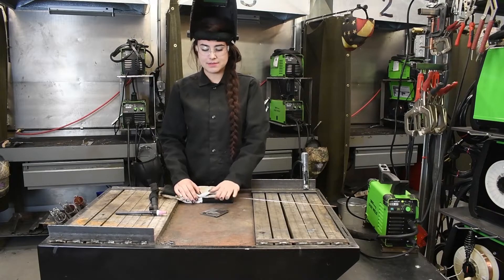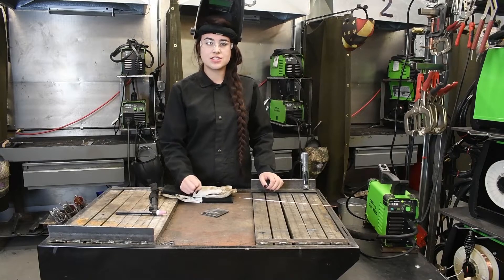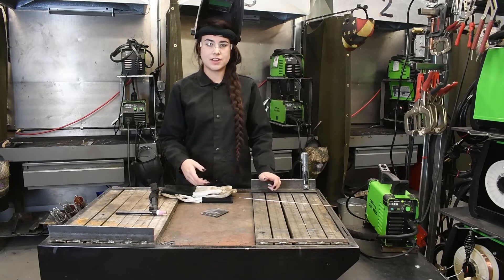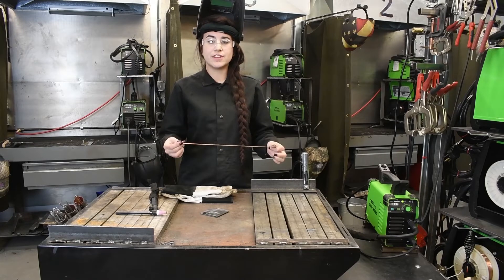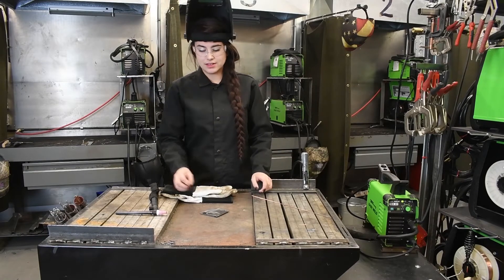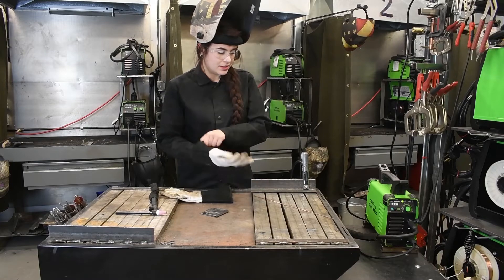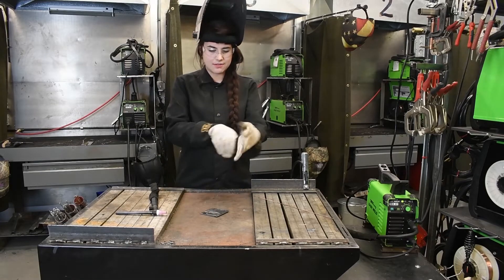Before we get started welding, I'm just going to tell you what I'm going to do for the first half of this weld. I'm going to do an autogenous weld — that means I'm going to just heat up the base material and fuse it together without using a filler metal. In the second half of the weld, I will use this 1/16th filler metal to fill our weld. This setup here is just a lap joint, so we're just going to do a flat, small fillet on this lap.